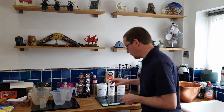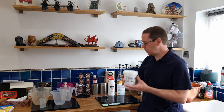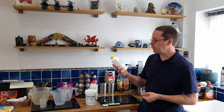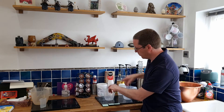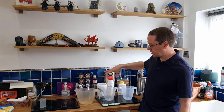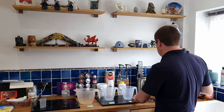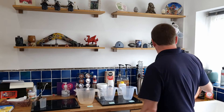We've got three different things to test: citric acid by itself with water, then citric acid and table salt, and finally citric acid with hydrogen peroxide at 3%. I'm going to make up three mixtures in these pots — all around 500 ml of solution in each — with little post-it notes to identify them. I'll be soaking a couple of handfuls of my copper SPP in each and we'll leave them for an hour.